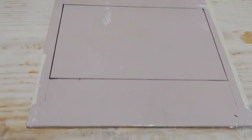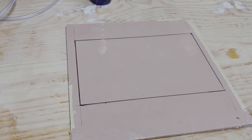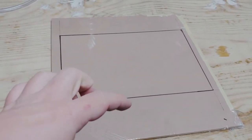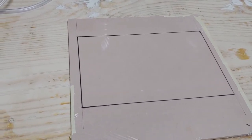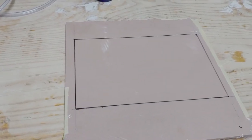Tonight I've wrapped this piece of MDF. That's a piece of MDF wrapped in pallet wrap or saran wrap. I've drawn out the landing gear bulkheads on that - that's 12 inches by 8 inches. That's the landing gear attach point. This is going to get 22 plies of bidirectional. It should amount to a quarter of an inch. We're going to measure that when we're done to make sure it's the right thickness. Then that's going to get cut up and installed into the landing gear hardpoint slots in the landing gear bulkhead.